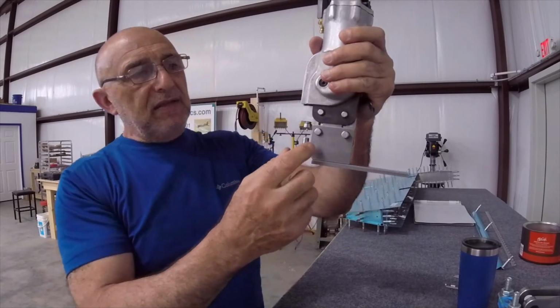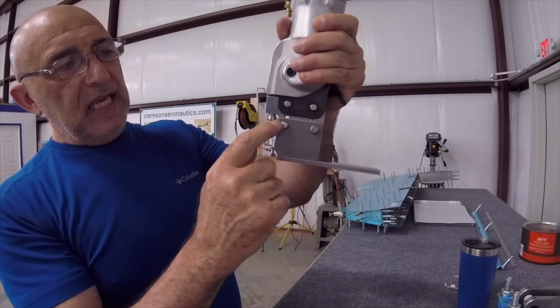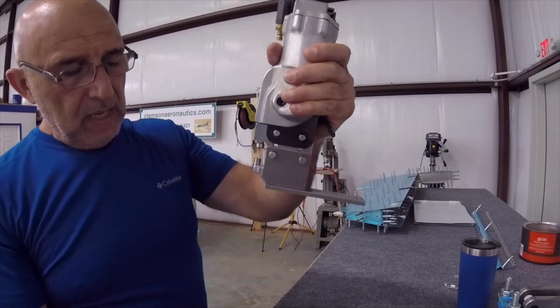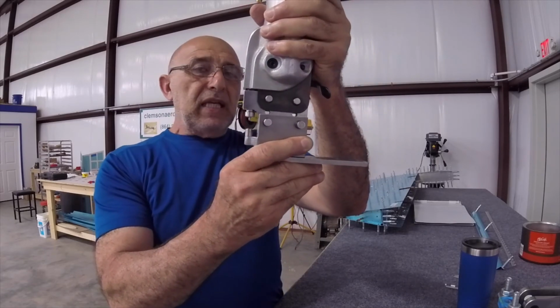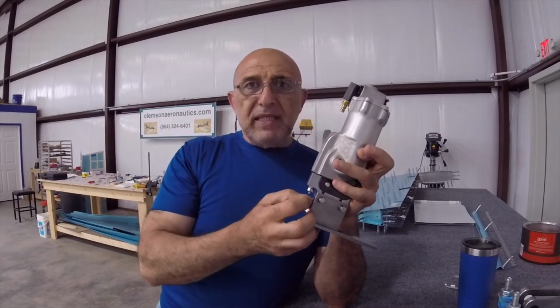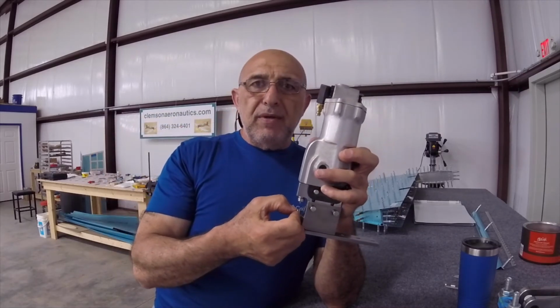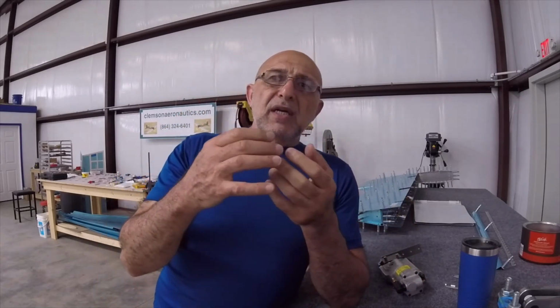It only compensates for the little bit of play from the pins, and these pins and those pins. And once it's stretched to the limit on those pins, it doesn't do any flexing. So when you adjust this one, you need to pull the trigger where it comes down to meet each other, and that is your setting. You don't want to turn it a quarter of a turn or half a turn or anything like that. I think if you have it touching each other, maybe 1/8 of a turn will be okay.